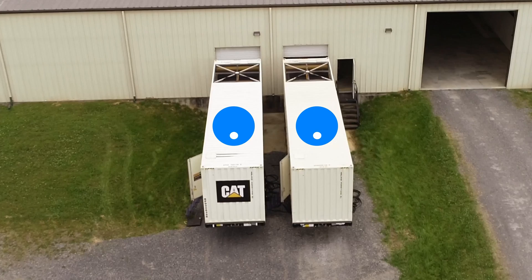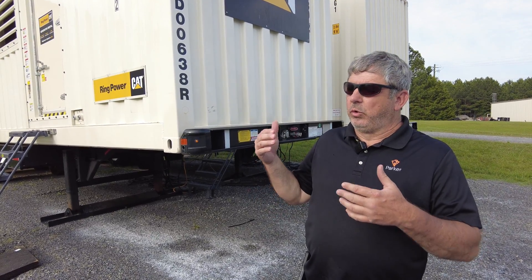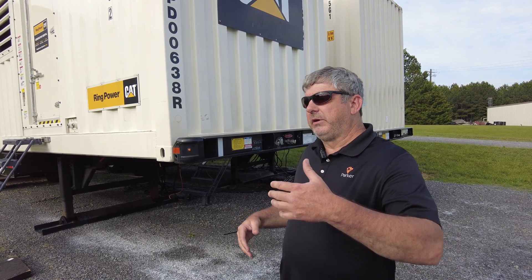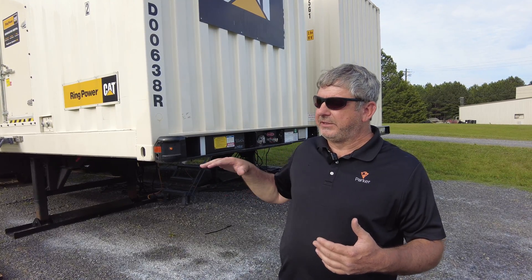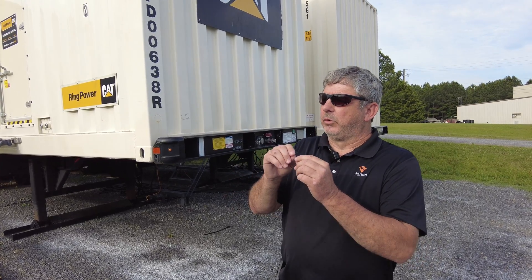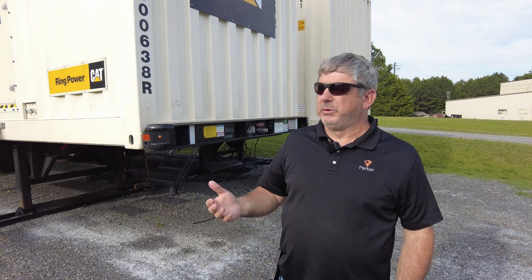Alright guys, so that video was because you guys asked for it — people wanted to see the engine start up, a cold start, and the paralleling process. We're still in the process of getting the software for ethernet paralleling, but what you saw us do is: we cranked one generator and made it manual, then cranked the other generator and put it into check, then closed the bus on the manual generator which energized the connections between the two generators. We had a display showing the frequency leading the other generator, and when it got in range I was able to reach up and close the breaker. Pretty cool.